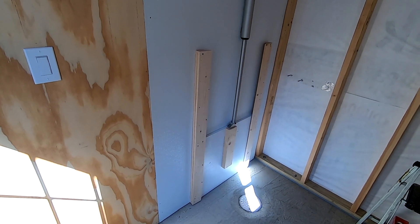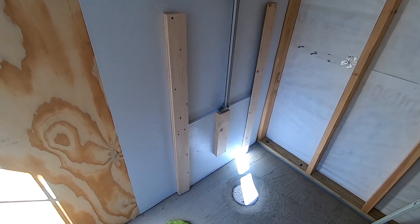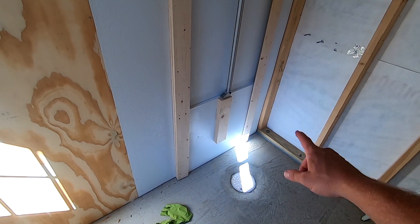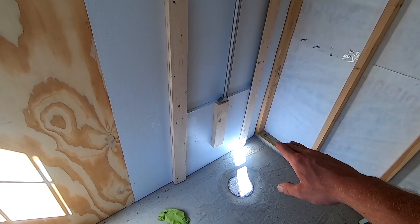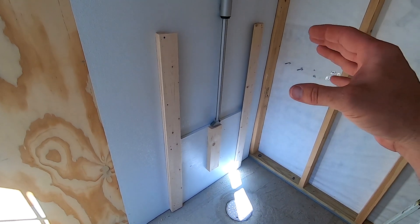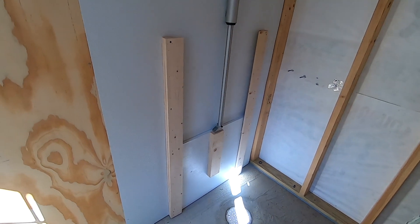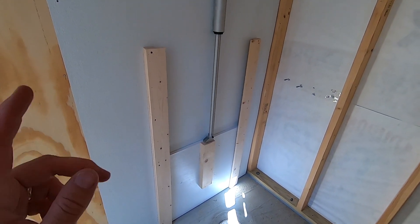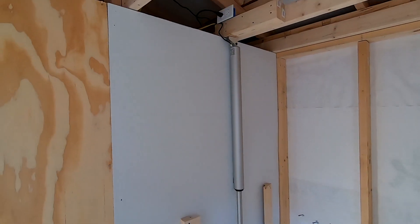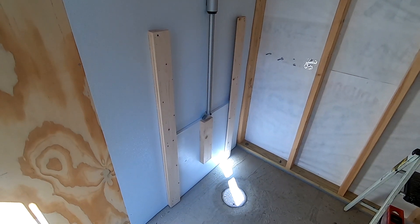Maybe you learned something and want to try this for yourself. There are a lot of things you could do — if you're concerned about the door coming down on your dog, you could put an infrared sensor that cuts power if there's anything in its path. That's why I went with a lower-force actuator — it only has 22 pounds of force. If the dog does get under there it'll probably jam the motor and overload it before it can do serious damage. I'll put links in the description to all the parts I used in making this door. If you have any questions, leave a comment below, be sure to like the video, and until next time, we'll see you later.